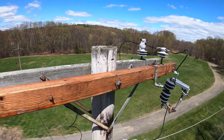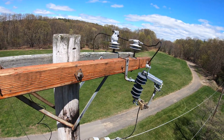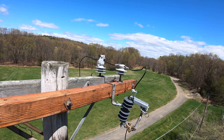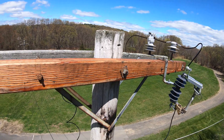Okay, new cross arm on there. That's a fuse holder with the fuse in it. That was the problem — it didn't have that insulator on top and that wire dropped down. It used to be a different wire, I'm sure, and it burnt the top of that cross arm. So I guess we're done here.